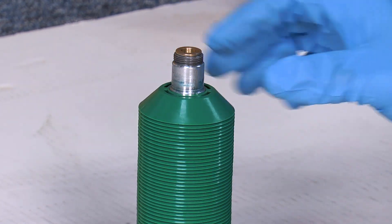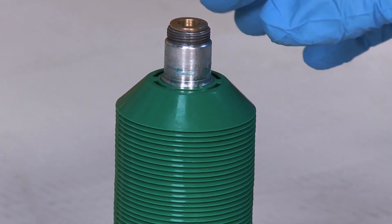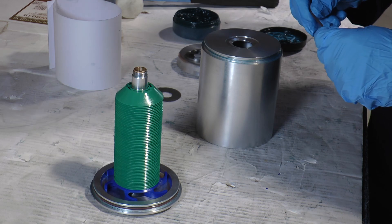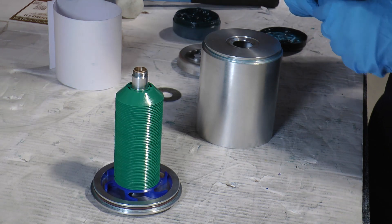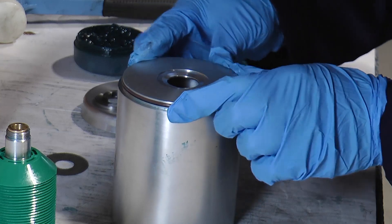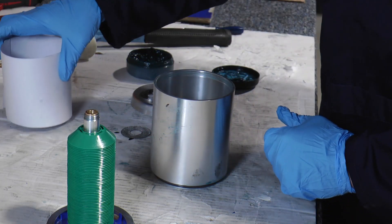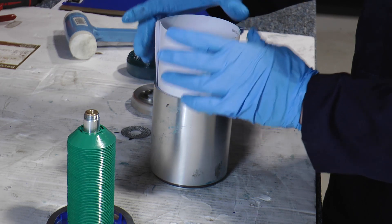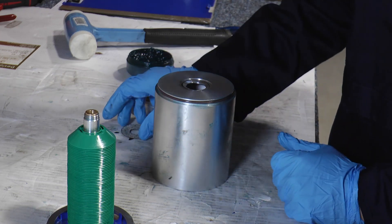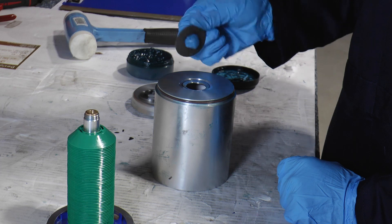At this point it's very important to check that the discs are level with the step on the bearing tube. If the discs are a little bit lower, then we need to replace or add an additional disc. If we removed the O-ring from the top of the bowl wall, we now need to replace it — put a little bit of grease on and reseal and check. We can now put a new paper liner inside the bowl wall, just squeeze it and then slide in. Turn the bowl wall over and now we need to put a new mesh screen, ensuring that the coarse side is facing up — you'll see the difference between the two sides.